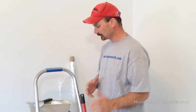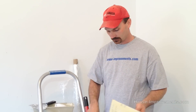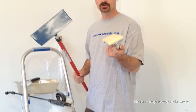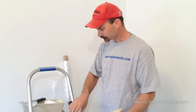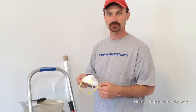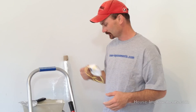I'm just trying to show you what we need. We've got the sprayer and the plastic. When you're done you're going to want to sand it depending on what you're doing — whether you're painting it flat or retexturing it, you'll want to sand out any nicks and gouges. You can use a hand sander or pole sander; typical drywall tools are really what you need. You'll also need a stool or ladder to stand on. A lot of these older stipples can have asbestos in them, so it's a good idea to wear a mask and even safety goggles.